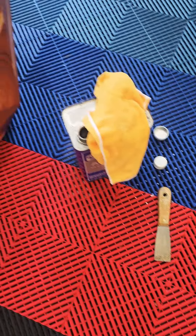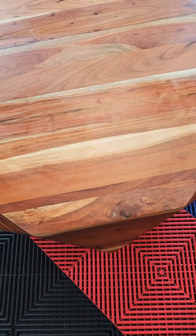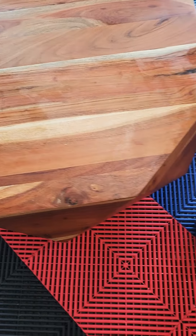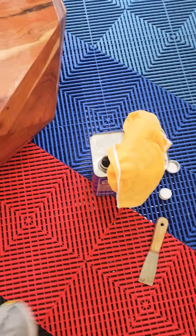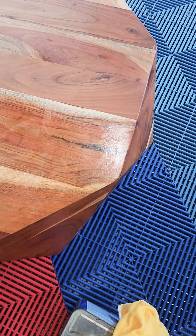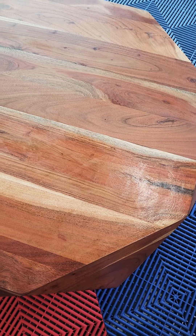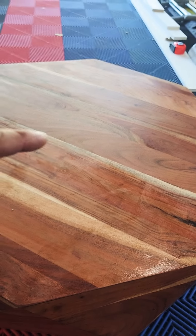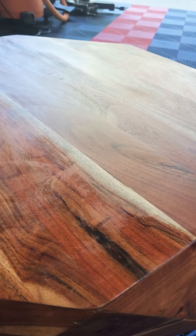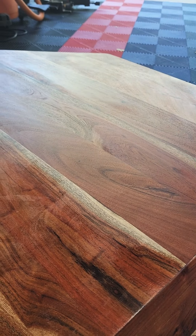In the past, I've used a scraper — I poured the material on the top, used a scraper, and just kind of moved the scum around, let it start to gel up, and then tried to wipe that off and go from there. I was reluctant to use a scraper here, thinking I would probably damage the wood, because it's not a hard surface like concrete or stone. But what I did — you can tell — that front half from that line, you can see it's all completely matted out, de-glossed. The coating, whatever that crap is, has been removed.